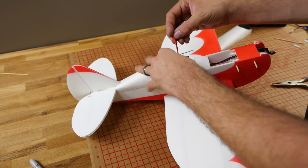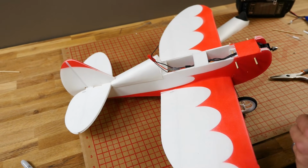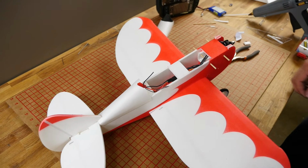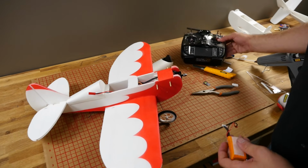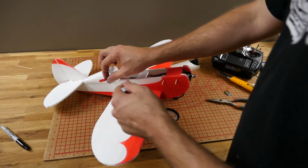Alright, I'm going to let my ESC stay loose, and that way we can move this to the side to get our battery in. Speaking of batteries, let's go ahead and put it in, get our control centered up. So with our prop still off, we're going to go ahead and turn this on, and we're going to go ahead and make sure our channels all have the right control throws and the right direction.